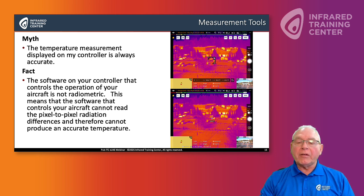And why is that? That is because, again, the software that operates your aircraft is not radiometric. In order to get accuracy in temperature, you'd have to follow set procedures that we talk about in the Level 1 sUAS thermography course in order to get accuracy in measurement, including measuring reflected apparent temperature, making sure the emissivity is correct. Even though those might be in your controller, they cannot impact the temperature measurement unless it's in radiometric